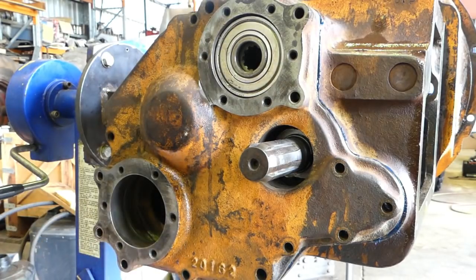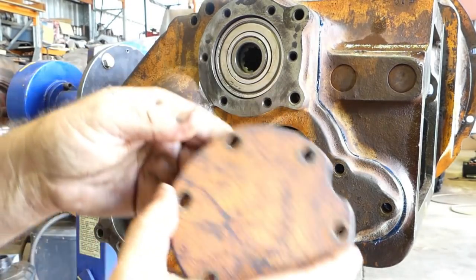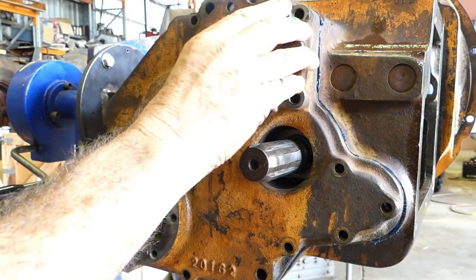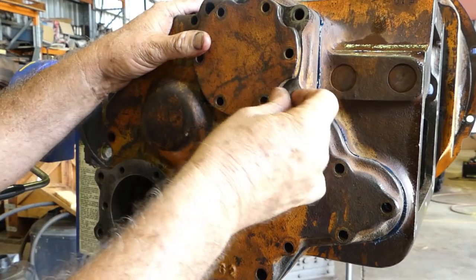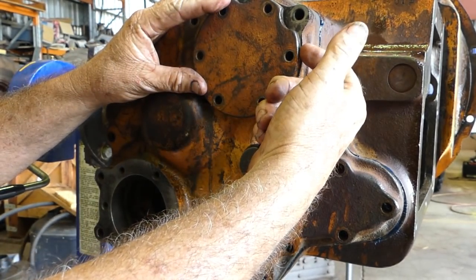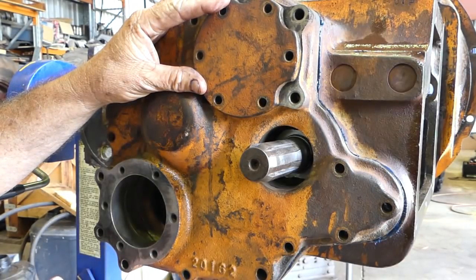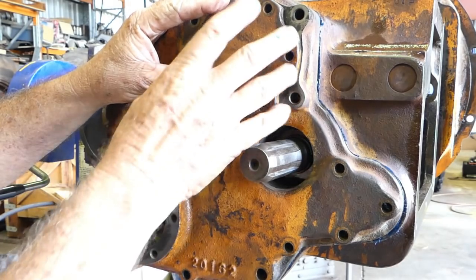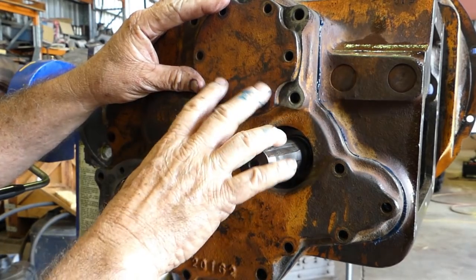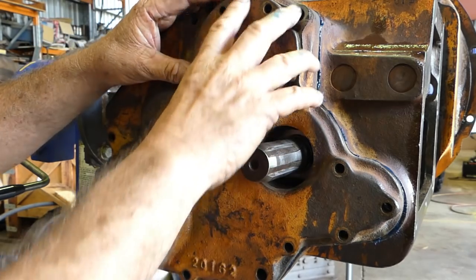We have another plate up the top here, and this is the plate, and this is shim adjustable. So once we have everything bolted up, we just put a couple of bolts loosely in here, and we just see what gap we have there. And say there's 20 thou there and we have a 10 thou shim. Well, if there's a 20 thou gap there, we'd actually put 30 thou's worth of shims in. So it had 10 thou movement, and we're not forcing that bearing in any way.